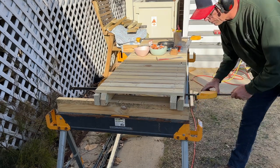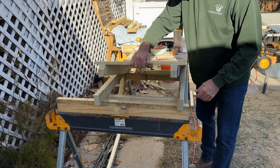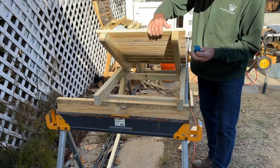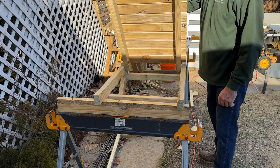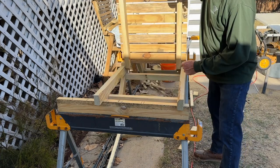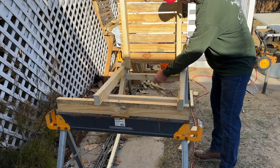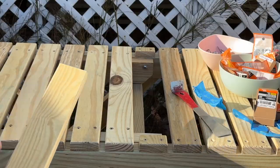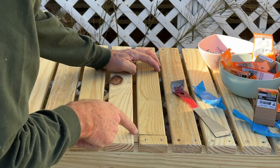And I could take these clamps off. Even though I haven't put the second screw in all of these, I could remove a shim and it moves very nicely. You see where it pivots at right there. And also you see I have this other chamfer on here, and the reason it's there is so it doesn't hit this stretcher and it clears it safely. This all comes down. This is the cut piece here. I bumped it a little, but I can clean that up.